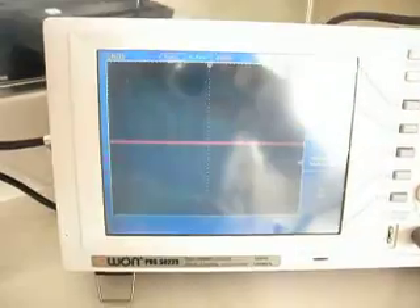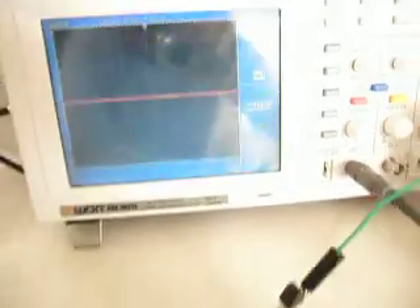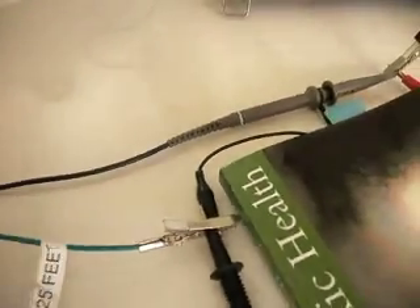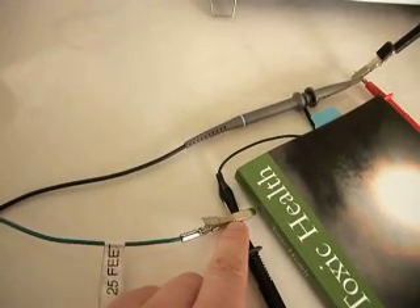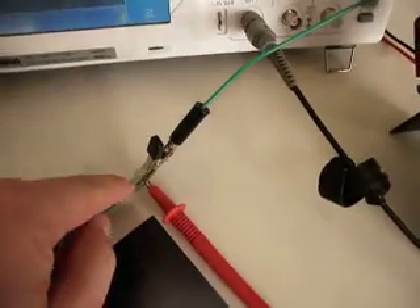And this is not actually true, because what's going on here is that the oscilloscope grounding connection is not actually grounded to the garden. Because it's actually plugged in on mains, it's actually grounded to the wall. So we have our negative probes measuring the same ground as our positive probe, and as you can see, the indication is no difference and no effect on the waveform.